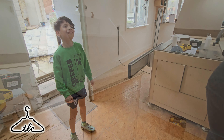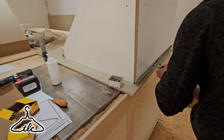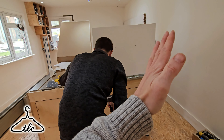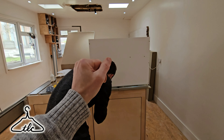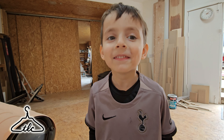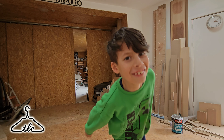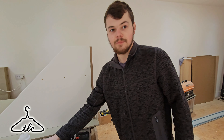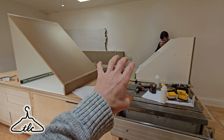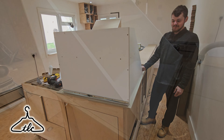The small part of the runner is on now. This is the front. We've made the small part of the runner flush with the front because the bigger part of the runner is flush with the bottom of the carcass. These runners are a little different from the standard ones — the metal ones are flat and flush. We got in as many screws as we could, all 20s. We've made this drawer a little less deep than the carcass — the runners extend 780, so the drawer is 20mm short. It makes no difference; it just means if something got stuck behind the drawer, we've got a 20mm void.